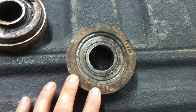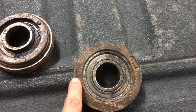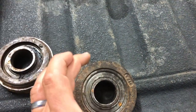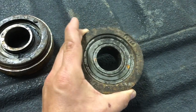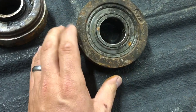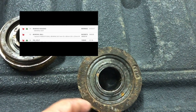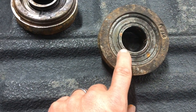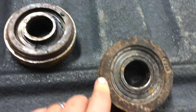New Holland has three rollers — they use this same bearing on two of them, which require this housing. One is a smaller diameter where the bearing goes directly in. They offer this as a New Holland part number — just the bearing — and they also offer the full assembly as a part number. The assembly is about double the price of just the bearing. So what we're going to do is take this to the press, press this bearing out, get new bearings, press them back in, and that's going to save us quite a bit of money.